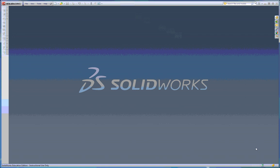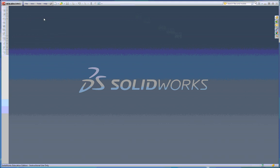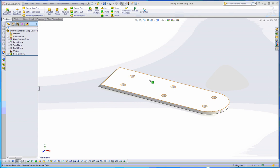This is the fourth and final video. We're going to show you how to take the parts you've already created and bring them into Torchmate and add tool paths. I'm going to go to File and open up the recent parts — the strap and the triangle. We'll start with the strap. I want to get this geometry into Torchmate so I can add the plasma cutting tool paths to it. All I have to do is open a part file.